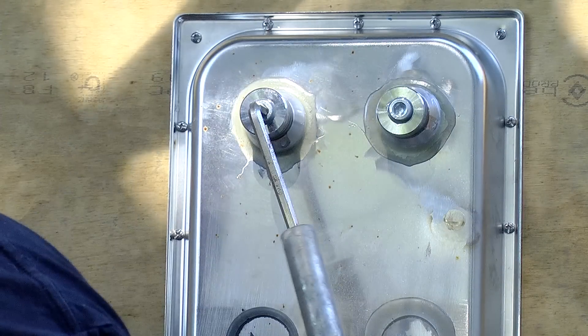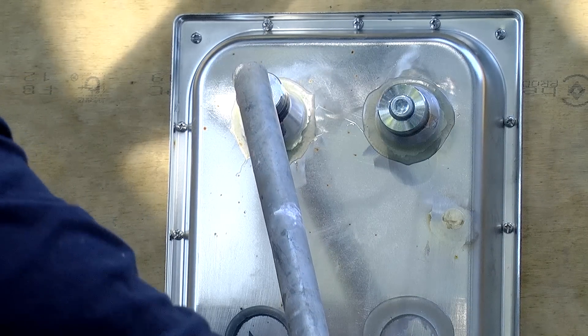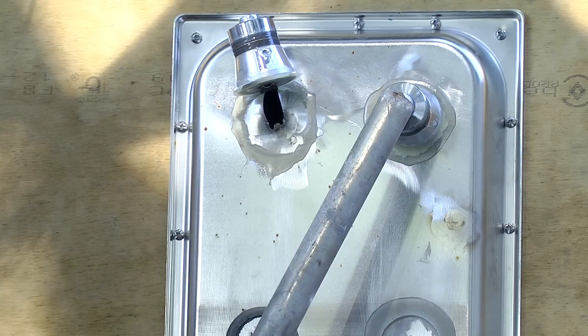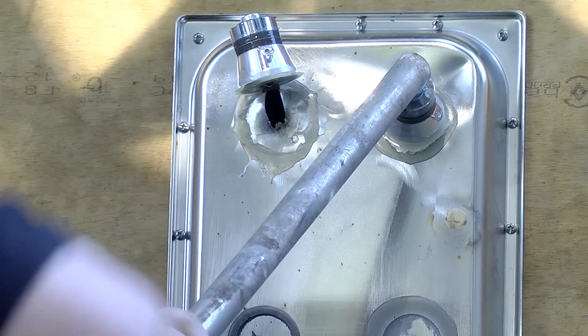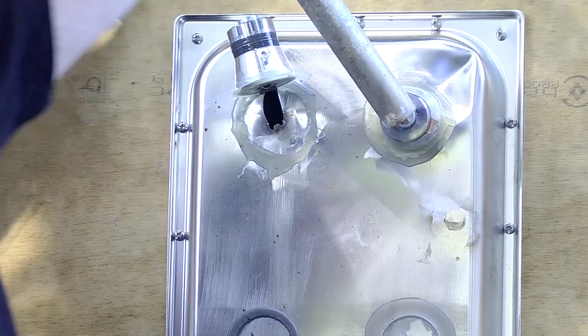I realise this isn't the most scientific of experiments, but it does show a few things. Firstly, JB Weld is really not the best product for this task. Secondly, the high-strength epoxy adhesive can handle 25 to 30 kg — definitely better than JB Weld, but nowhere near as effective as securing that bolt with welding or brazing. I decided to go further with the last two transducers using a piece of metal pipe to see what it would take to tear them off. The welding had weakened the tank metal so it eventually gave way. For the silver-soldered transducer, I couldn't get it off — the tank kept bending and the middle of the transducer bent, stopping me from getting leverage. I stopped trying because I think the point was made well enough.